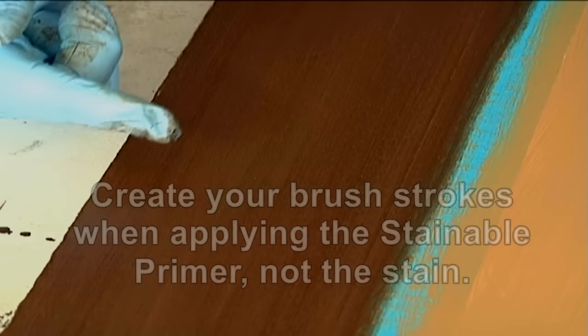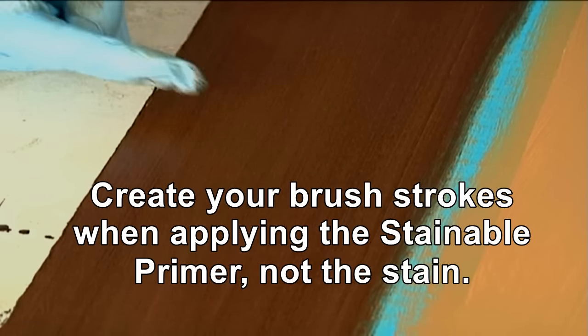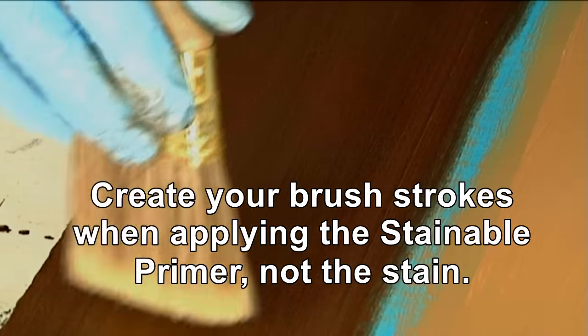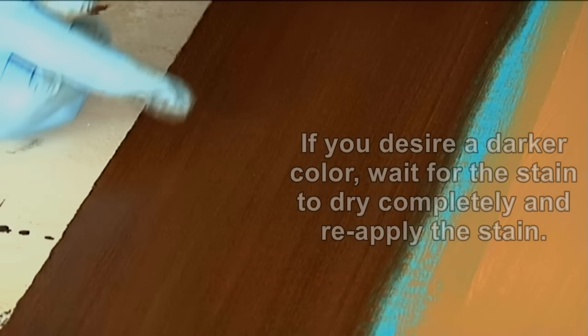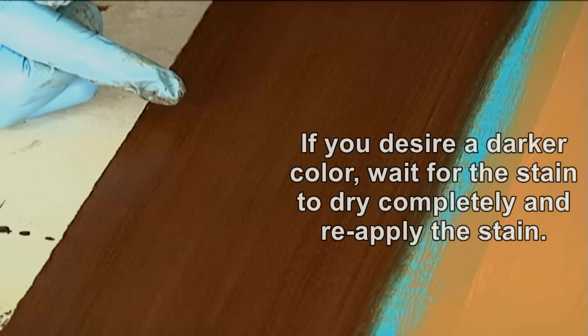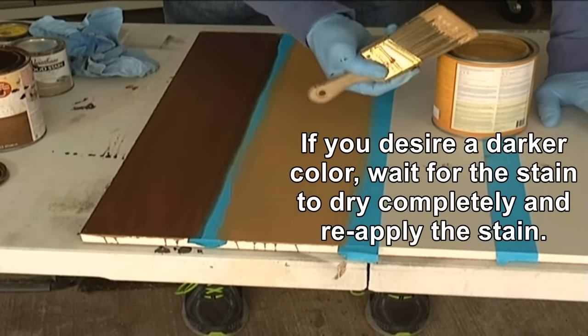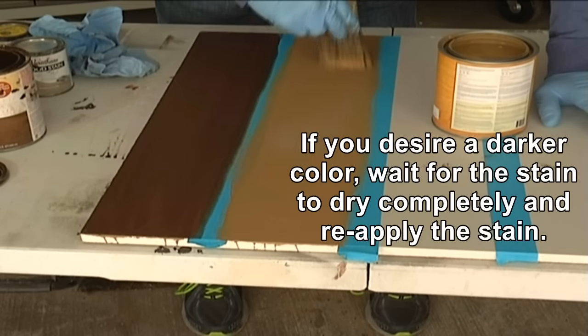You see this little area right here? Look how you have lighter and darker streaks in here, and that's what you want. This brush is going to help you get that. When you put your brush on like this, it's going to leave little lines, and those tiny lines will give you that wood look, that hardwood look. When you want to pull grain, you put a first coat, let it dry, come back and put your second coat, and that's the coat that you want to put the grain on, and you'll see what I'm talking about.